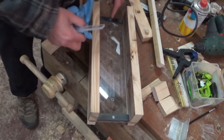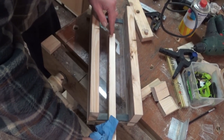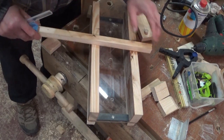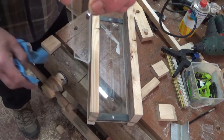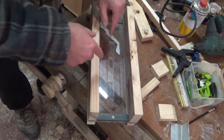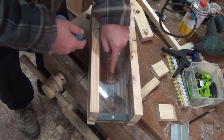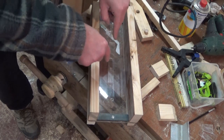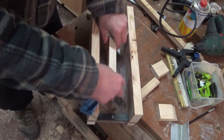The reason I'm putting that piece in the middle is the depth of the metal. So if I put a piece on here that I've clamped in and press it down, it can tip instead of being flat. So what I'm going to do is put this piece in the middle layer so my workpiece is always set on that and could be squared up by these left and right. Where I'm actually working is supported fully in that place. So therefore if I'm doing an end stock or a side stock, it's supported completely.